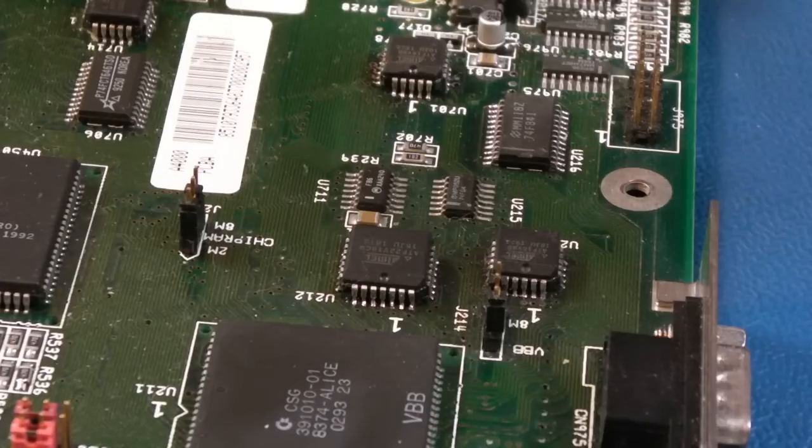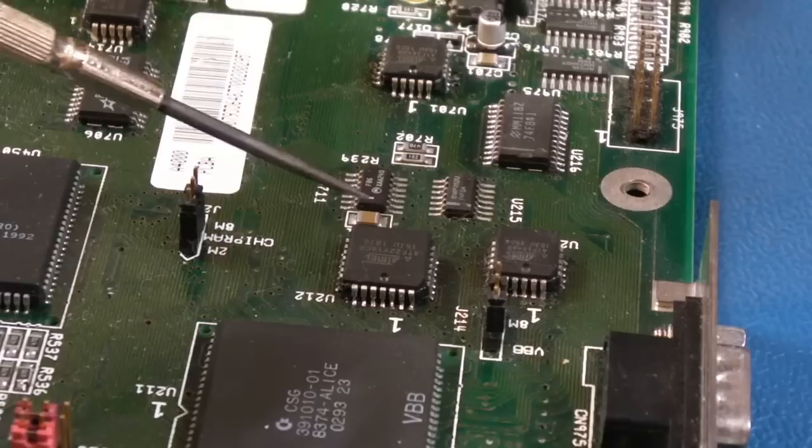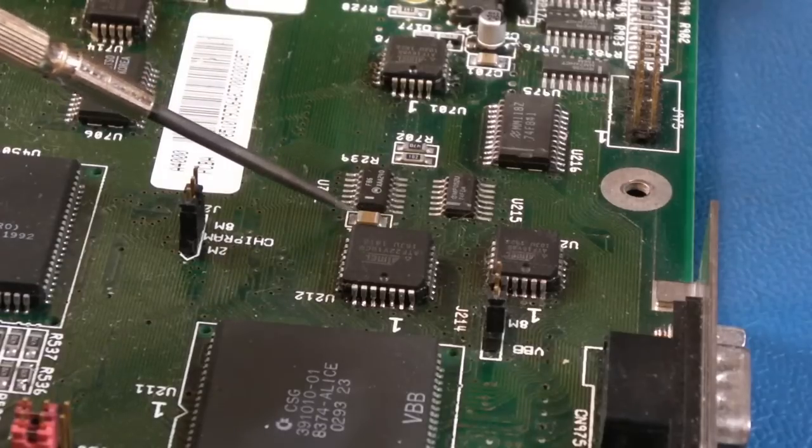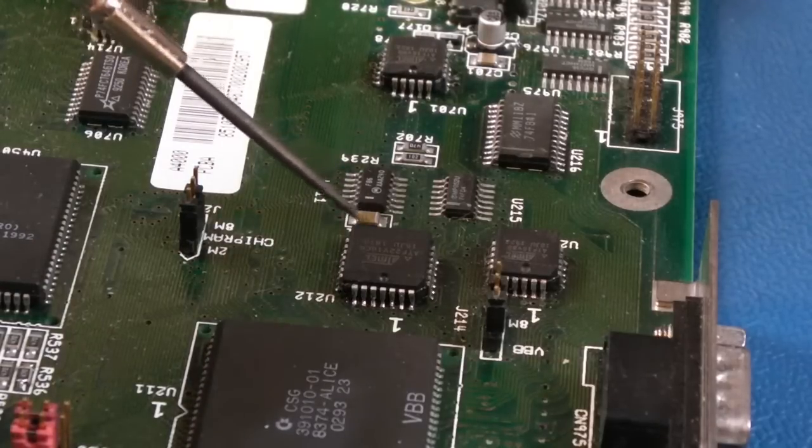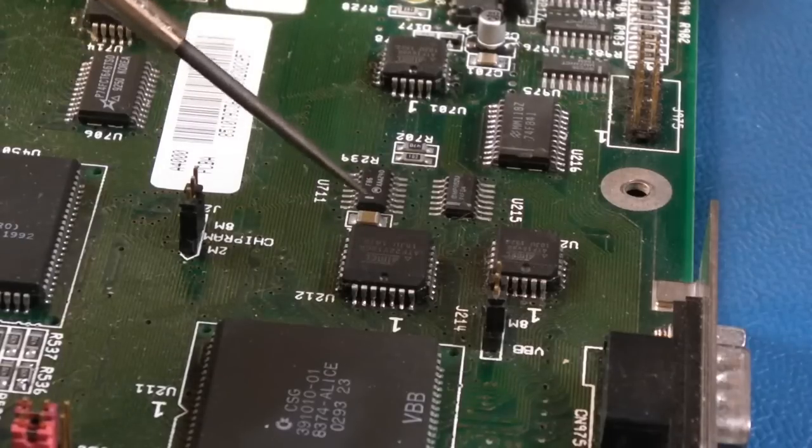It was in the terrible fire series there. I think it was towards the back end. It was one of the final things I had to do to the board, I think I kept. Or it might have been the one that went to Stephen. I can't remember which way around it was. But nevertheless, one of those 220 nanofarads under the kickstart ROMs just blew itself open for no reason. It hadn't been stressed. It hadn't been cracked. It just decided to short-circuit. So it's interesting, isn't it? Whatever manufacturer Commodore used for these, they seem dodgy. They seem totally unreliable.